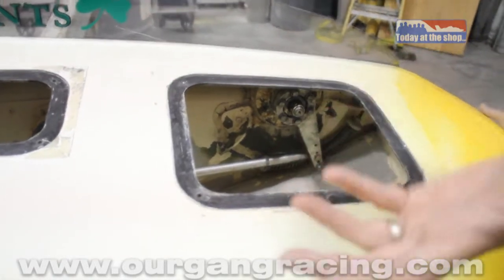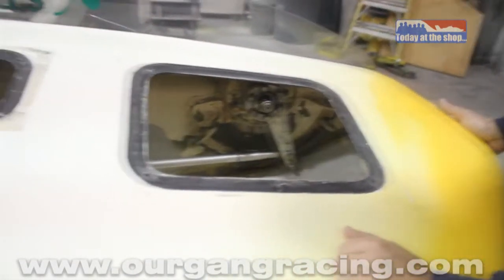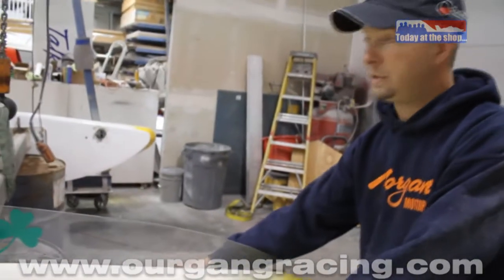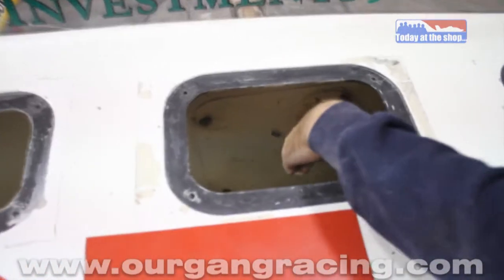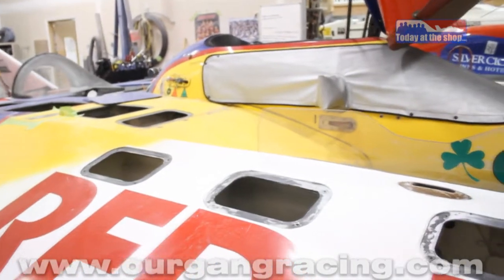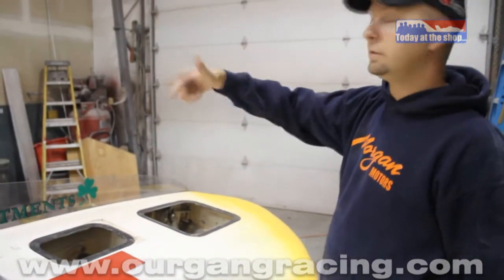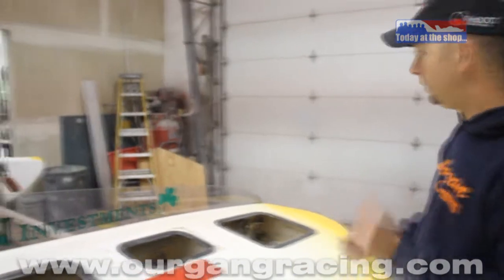Kelly Stockland, who happens to drive the Bucket List Racing, is also a master machinist and he built all of the hardware in this boat and a lot of the hardware for the entire fleet of Unlimiteds. This is an aluminum arm that attaches to a spud that goes through the hull, through the air trap and attaches to the outside of the canard. It has a tie rod that runs back to an idler. It's got a quarter inch Morse cable that runs all the way down the length of the sponson air trap, takes it right at the bullnose, goes into the cockpit, around the backside of the cockpit and up to a Bergeron cavitation plate pedal that we use to operate the up and down section of the wing. It's a redundant system with a cable on the other side with an arm, an idler and a cable that runs all the way up to the wing also, and they work in unison so you don't get a twist in the wing.